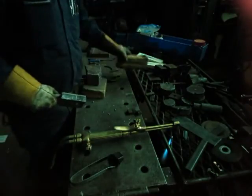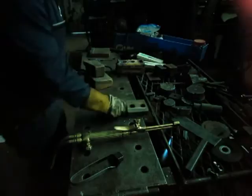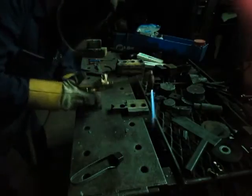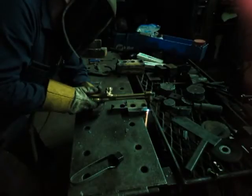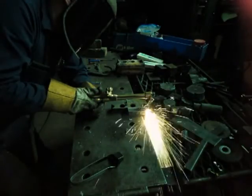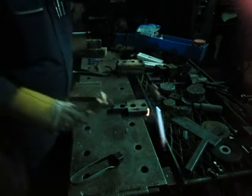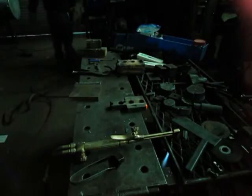Here's a piece of one inch — we'll attempt it with the same setup. This is kind of pushing things; 40 psi is a little low for one-inch plate in my opinion. Notice how I didn't get full penetration — just not enough oxygen pressure. Let's go on up to 60 and see what it does.